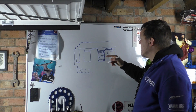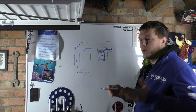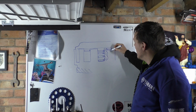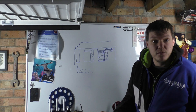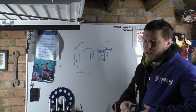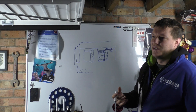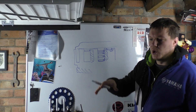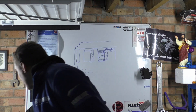More importantly, what it does is — the clutch size you want to make as light and as small as possible, but bikes are getting more and more powerful. And if you can distribute the stress over a larger area instead of just having it concentrated here, you'd want to do that. So to basically keep clutches small but distribute the stress over the clutch basket more evenly — or, the fact of the matter is they can't just keep scaling it up.